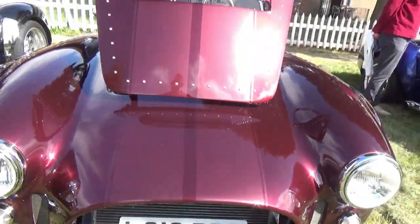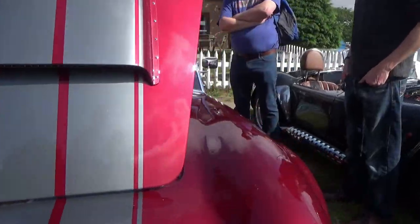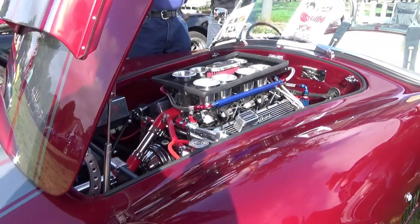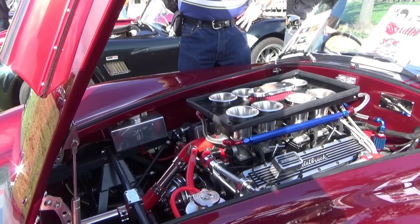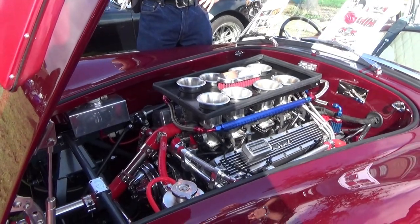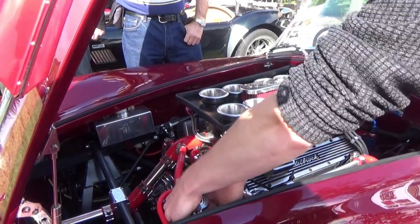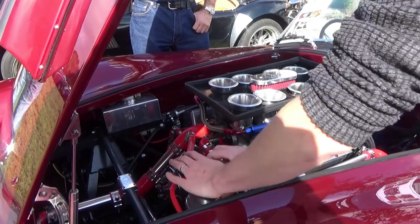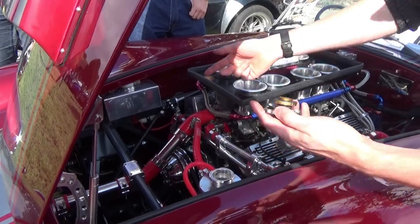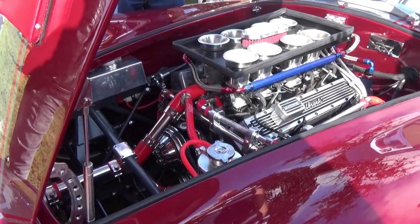The water thing there. Yes. I had a similar concern, the height of the water. So what I've tried to do is use relatively the highest point. I was thinking, how on earth do they bleed properly? I know some people have had problems. That's why I've gone from there, taken that off. So that's the highest point. My water level is actually like there, but it's got a non-return valve in, so it can just bleed it out then. Yeah, I had exactly the same concern here.